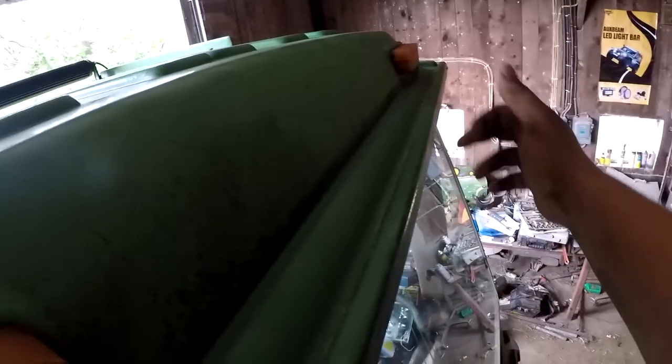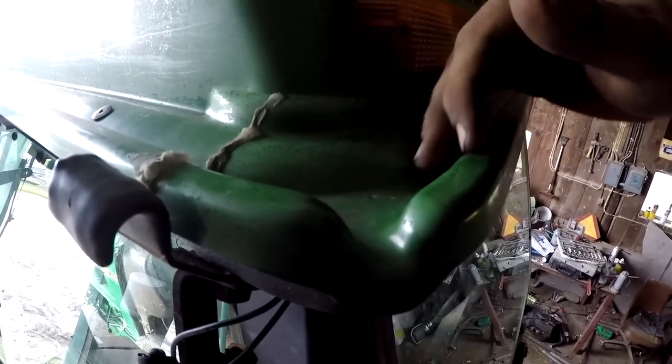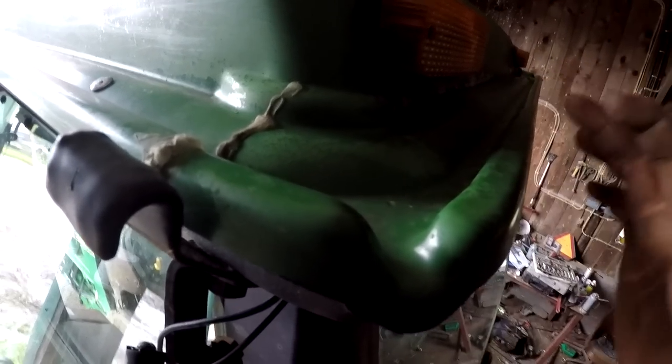It's not gonna be as bad as I thought. Here's the back of the cab — I'm gonna grab a tape measure and find the center. This little lip here, I'm gonna drill two holes in here, get the original mounting hardware, and screw it down. Then I'm gonna run this wire up here along the edge and then through here and through this hole in the cab. I'm gonna try to leave a little gap because mainly what these grooves are for is for the water to run out on top, so I still need to keep room for that.